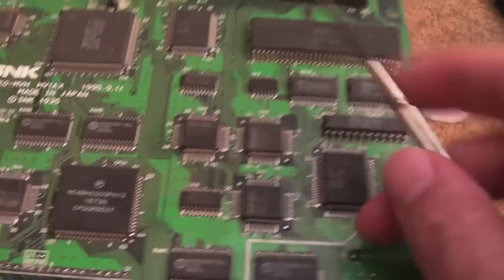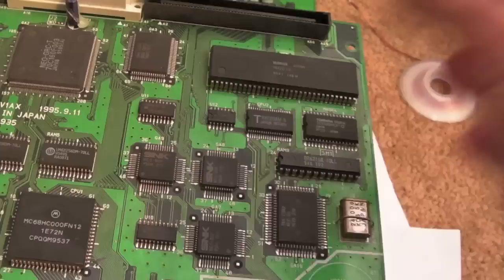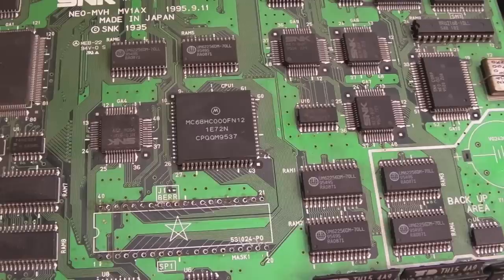And it would work. What I was going to suggest is it would work if I took the chip off here, the SM1. So I might do that. I might remove the SM1 from here and swap it over. If I got this up and running and we could get a BIOS back on there, the diagnostics BIOS, it may well get us into the diagnostics to see what's wrong with it. Maybe it's got a RAM fault somewhere, and obviously it would be missing the SM1, but we could always deal with that later. So I don't think there's anything lost by borrowing that to swap over onto this board, just to rule that out. We could still have a problem there.